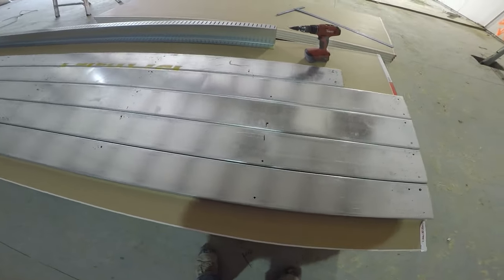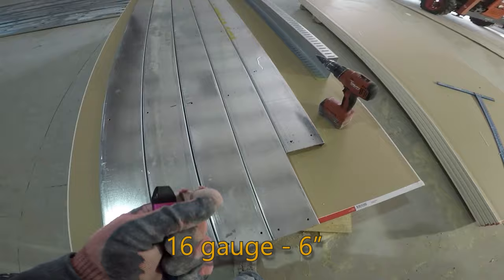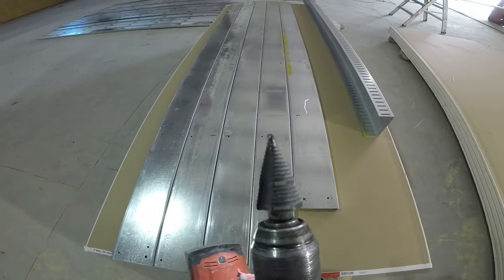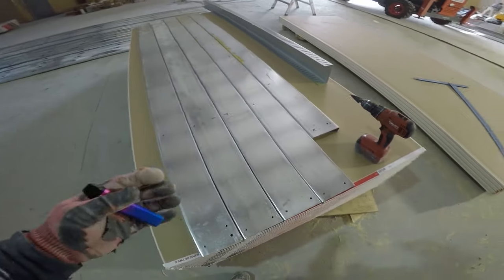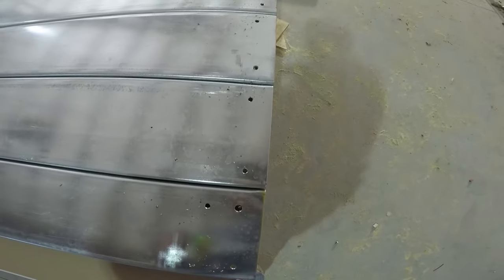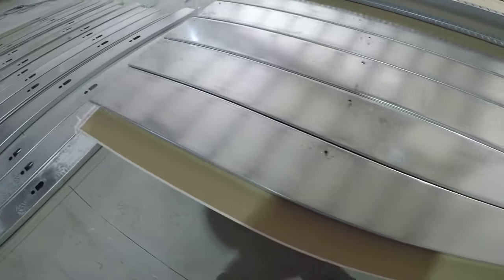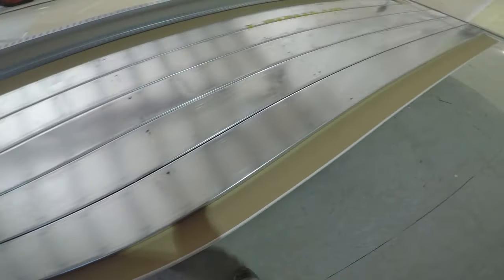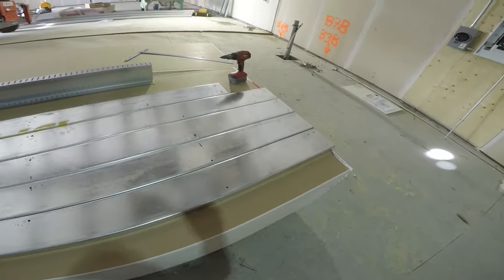Because this is really heavy gauge, I'm pre-drilling the holes for the pin bolts. The hammer drill bit won't go through this steel, so I recommend using a step bit — they just last longer. You'll go through three or four normal steel bits for every five tracks, so use the step bit. Two holes on each end, and don't go too close to the edges because you need room to get your hammer in to hammer down the pins. Then every two feet, stagger to each side. You can use Hilti pins in between to tack it if needed.